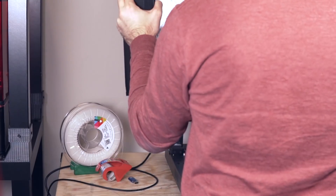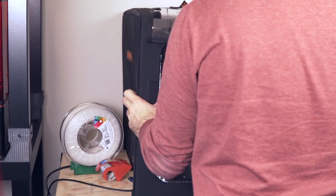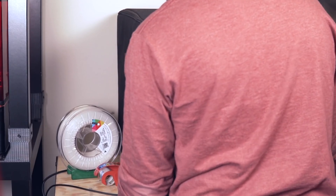An enclosure might not be a requirement, but I highly recommend it because adhesion is such a big deal with this material, and any sort of deviation in your environment can really affect that. For this, I'm just going to be using my Hot Box from Wham Bam Systems, which just pops up, throw it on top of the machine, and I'm ready to go. And lastly, as far as your nozzle goes, you don't need any kind of special nozzle. Polypropylene, at least pure polypropylene, is not abrasive in any way, so a standard brass nozzle or whatever you've currently got on your machine is going to be perfect.